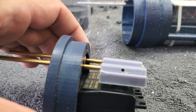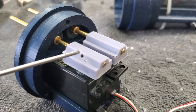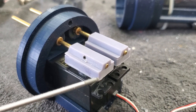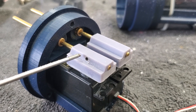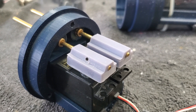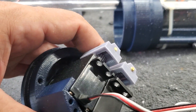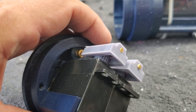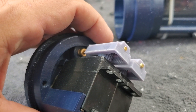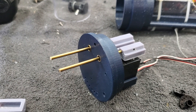These are the installed linear conversions. You can see a set screw here, which means you can insert the shaft and adjust the length to whatever you need and just tighten that down to lock it in place. And you can see that linear gear in there — I put a little bit of silicone grease in just to make sure that things move smoothly. I will show this to you in operation.